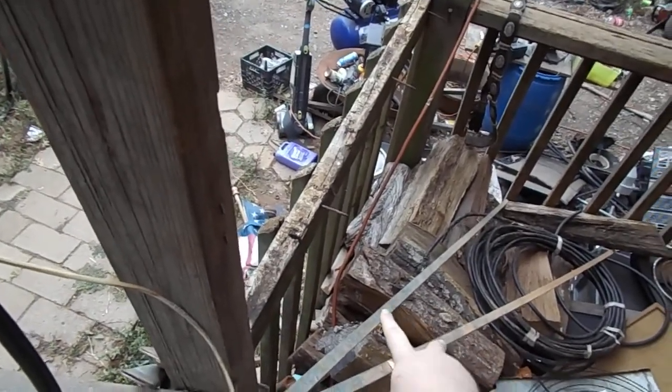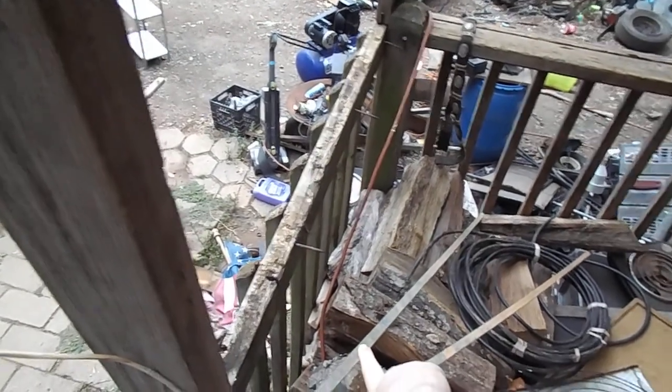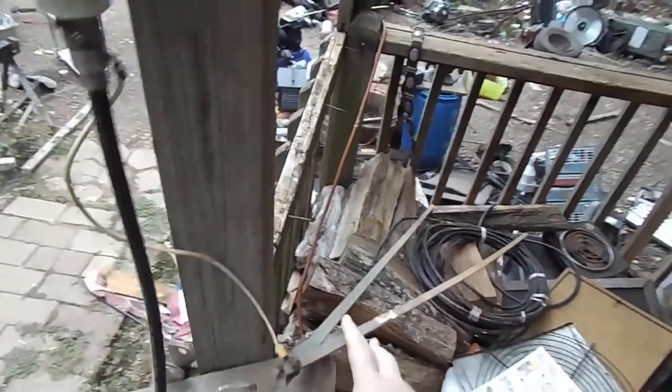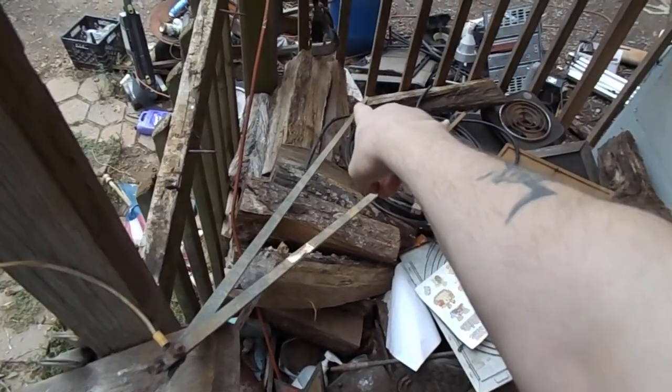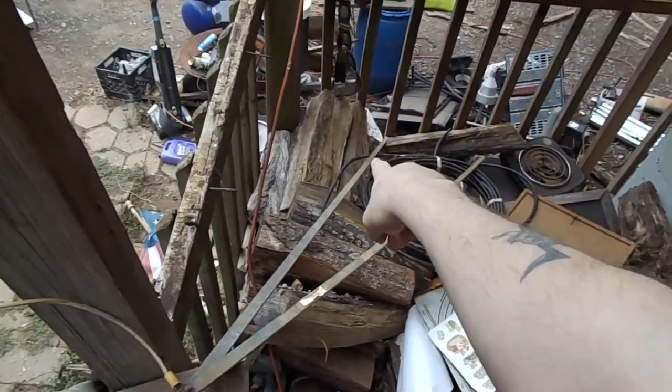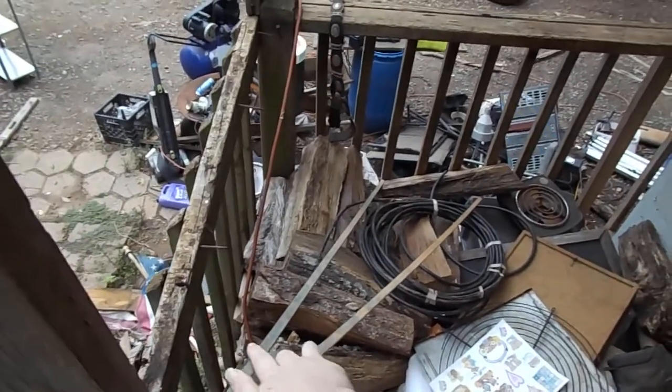The reason why I have two set up right here at this angle is it increases the impedance a bit to match it to the coax cable. Anyways, what this is doing is acting like an L-shaped dipole. There are two radials which spreads it out a little bit — it puts a little bigger beam width on it. So it's pointing way out there toward the city.